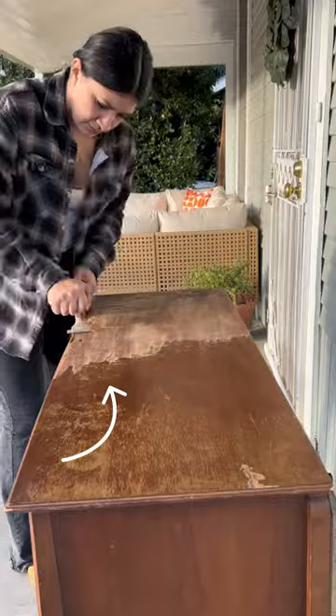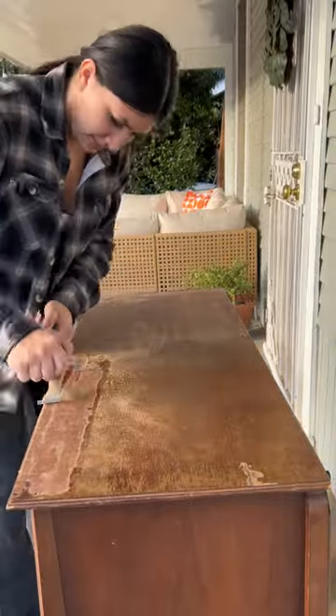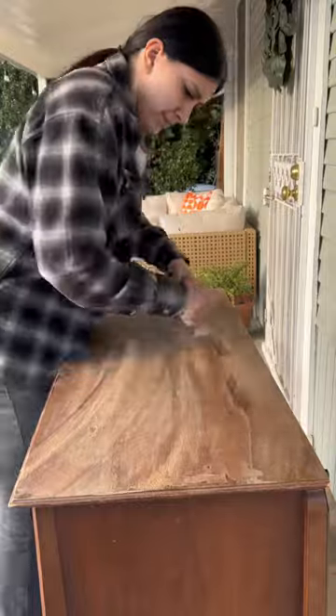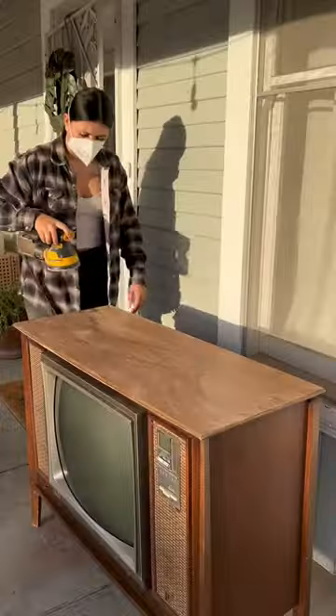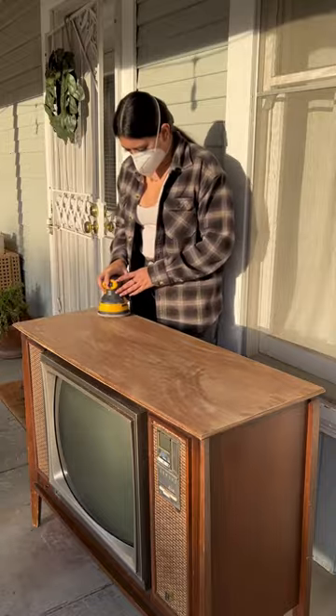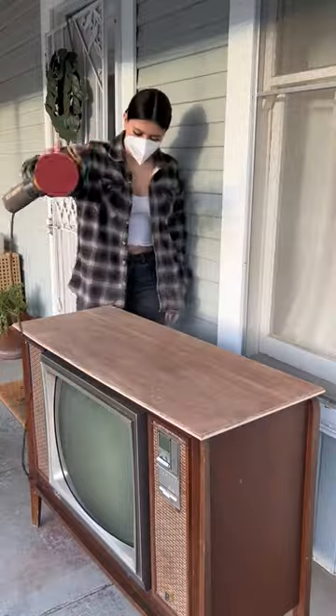As you can see, I've been scraping off the top layer of the finish — that's because I want to get underneath so I can sand and re-stain the top. There are plenty of other ways to do this, but I find that using a carbide scraper gets the job done the fastest. Now that the top layer is all gone, I can go in with my sander and smooth it out. I started with 220 grit and slowly increased my way up to 400.